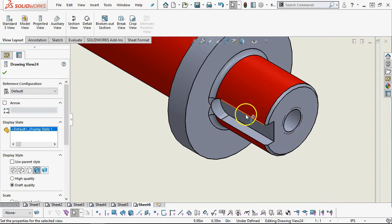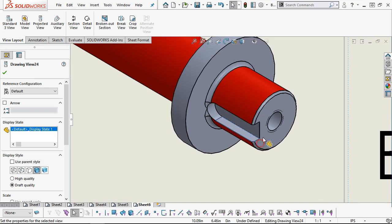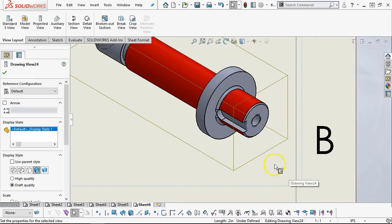The keyway, we'll put a positional, and it's just a 5 millimeter keyway. Probably need to go back into the model and verify my distance. I think I have a little bit of extra because of the way that this built out. I drew the top and I just extruded it down rather than figuring out where the keyway would intersect. All right, and keyways are fairly tight tolerance. I also want to say that, let's just go with that one. So 0.2 on the inch drawing.